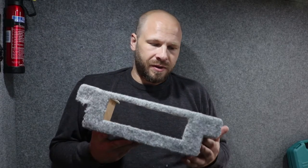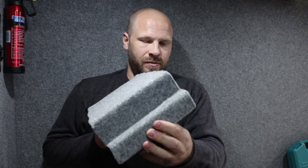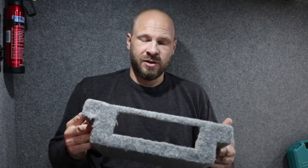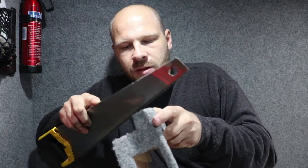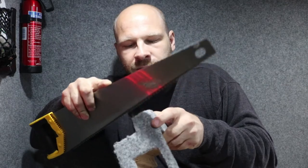I barely managed to get by with the carpet that I had, but I've kind of covered that now. It's pretty rough looking — certainly not my best work, but it's the best that I can do with what I have. Once the glue is completely dry I can probably tidy up some of the edges a little bit better. A trick I learned: once the glue is dry, you can just run the blade over the edges, and what that does is it breaks up the adhesive and roughs up the carpet slightly, so any joins or poorly put together seams can be hidden a little bit better. Sometimes it works better than others, but that's how I'll mask some of my shady craftsmanship on this one.